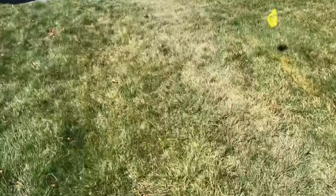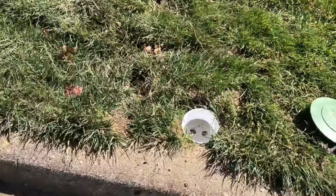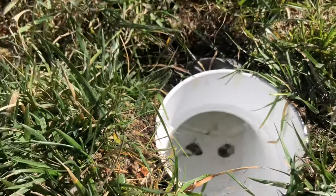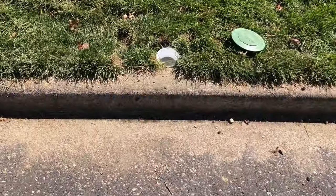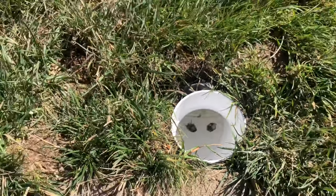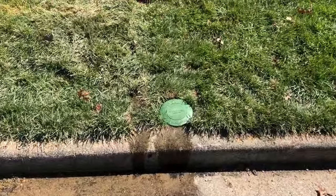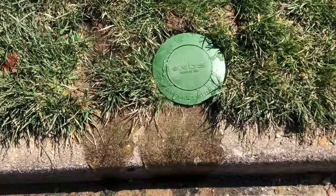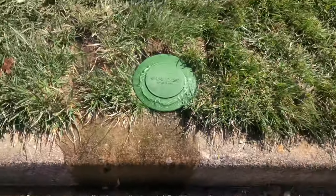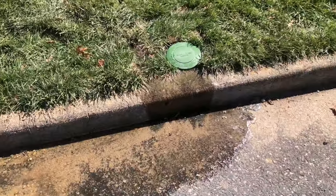It's also picking up the water. We tried to put the grass back to make it look like we were never here. You can see the water coming in — as it comes down it's trying to fill up the mini dry well so there's no more head pressure to build up and push the water up and over the curb. It can then drain back into the ground to help prevent against freezing. Now we wait for it to build up and here we go — water comes down and facilitates to the pop-up. This will be popping up a lot more when we have actual head pressure rather than just hose pressure.